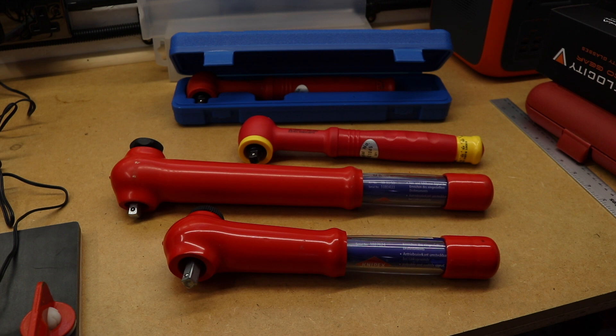Hopefully you've seen the tables popping up showing the results for each wrench. The results speak for themselves — the two Knipex wrenches are by far the most accurate. The newer 25 Nm wrench is all within tolerance, although some readings did get close to the tolerance values. The 50 Nm wrench has one reading out — the very last reading at the 50 Nm setting — with all values at that setting being very low and edging towards the tolerance, with that last one just going out of spec.